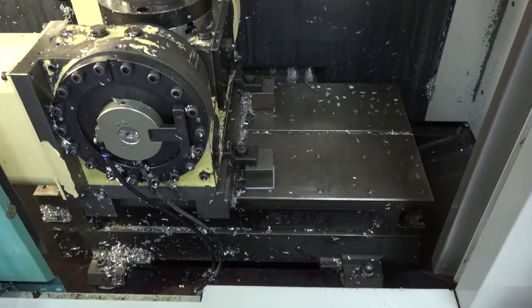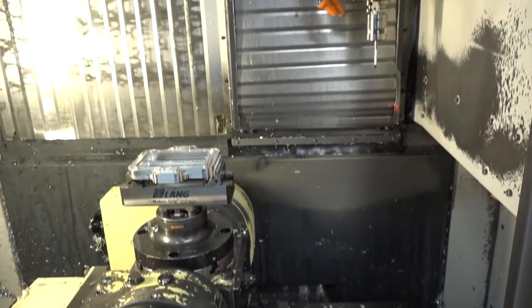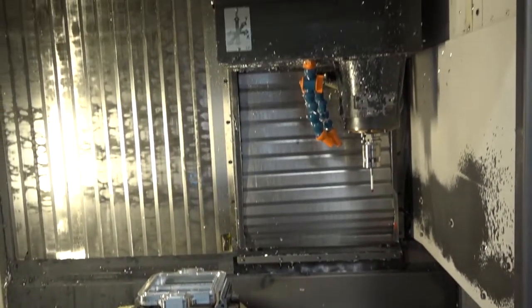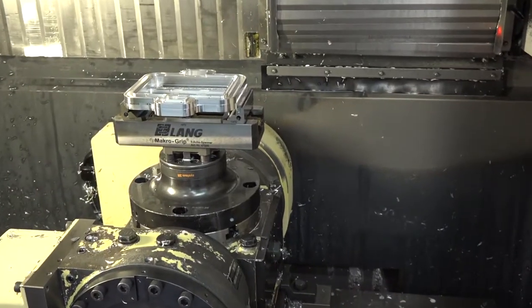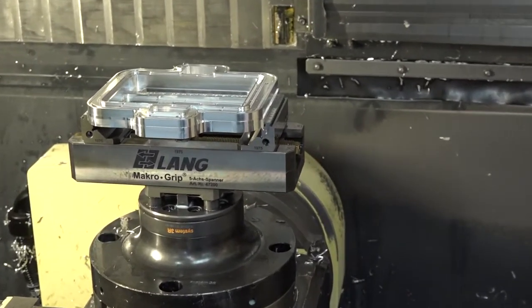And is that why you bought it? It's one of the reasons. Obviously it's a BT30 machine — it is very very fast — but with BT30 it has its limitations in terms of what material you can cut and depths of cut. Were you doing these components on a previous machine and have you improved your cycle times as a result of the high-speed Brother machining center?